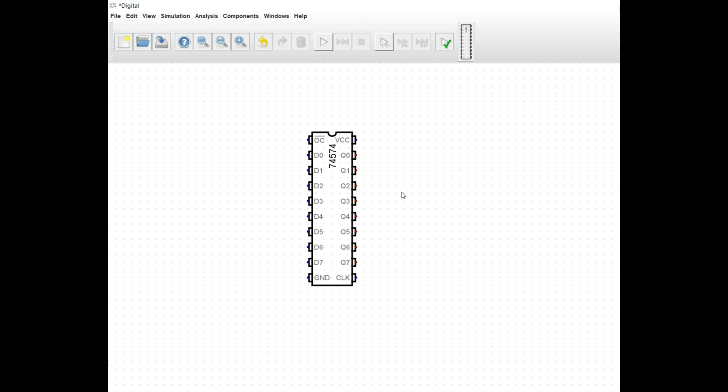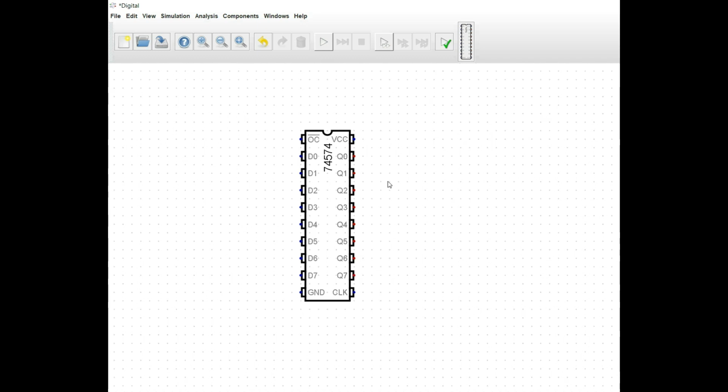Okay, so we need to construct a method of getting the data that we need, but at the same time we have to be cautious, because with CPLDs, unlike FPGAs, we have a fixed amount of flip-flops. For example, in the CPLD that I'm planning on using, we only have 128 macro cells, and each macro cell has 1 flip-flop. So for every flip-flop that we use, we are going to essentially lose an entire macro cell whenever we go to compile this. So that's another consideration that we have to take, is will our design fit into the logic device that we decide to use.